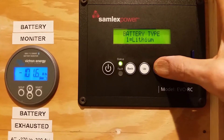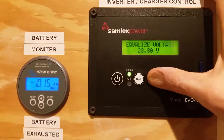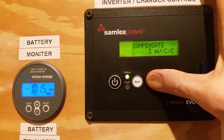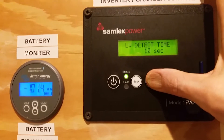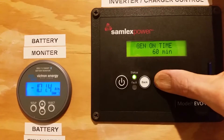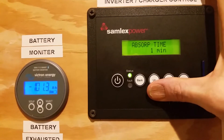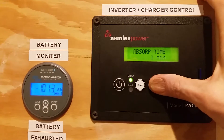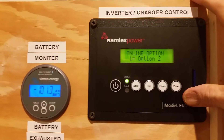In that other option I'm not using, you set the charging profile — there are several choices: three stages, two stages, four stages, and more. You have to set the absorption voltage, how much time it spends in absorption voltage, the float voltage, and the absorption time. Once that charging profile finishes, that's how it gets back into inverting mode.